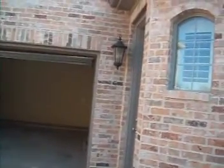I'm standing to the right of the garage door and I'm looking at the window here, and it has no caulking whatsoever. It's going to allow hot air and cold air in this winter, and water, more importantly water, to penetrate the building.